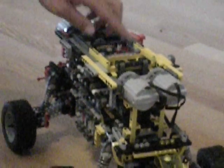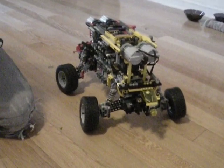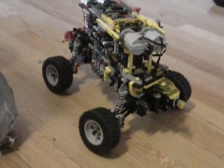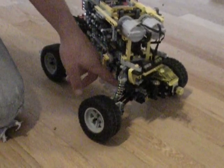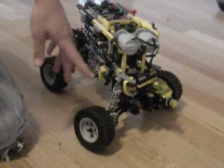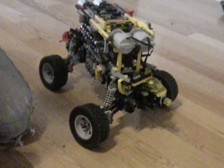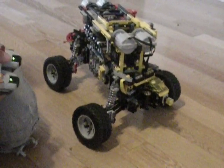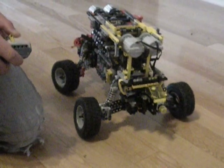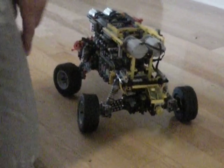I'll just demonstrate a little turning. Let's put her in third gear. One other function of having this 4-4 swivel type of steering is I must have an open differential in each front and rear end, because when it swivels, one wheel is actually moving back and the other forward. Any locked, spool, or limited slip differential wouldn't function correctly. I could have a lockable, selectable differential, but just based on how often I would need to steer, it's better just fully open. There is no center differential, so both front and rear get equal power at all times.